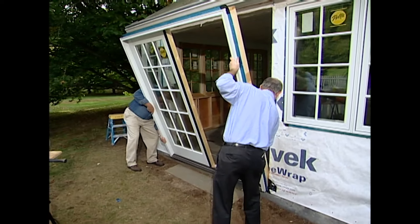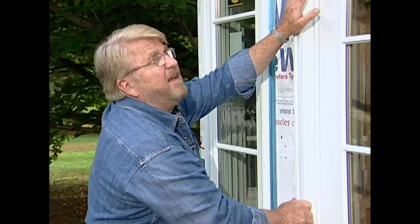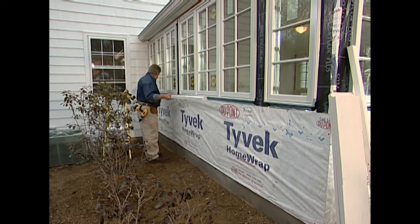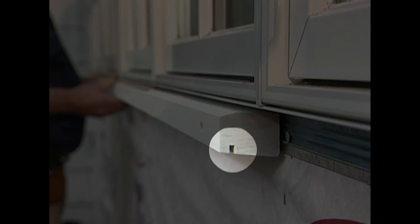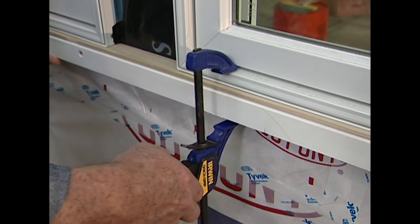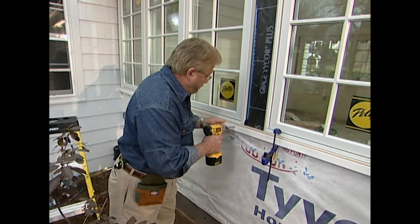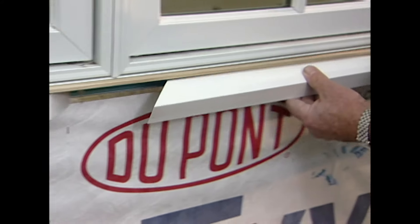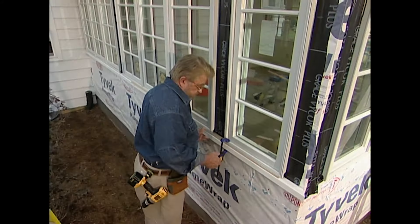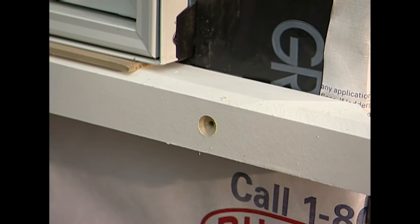I can't let Peter go yet. The sliding glass door is even larger than the window, but the installation is pretty much the same drill. With the windows and doors in, it's time to begin adding some exterior trim, starting with the sills. Notice the drip groove in the bottom — it'll prevent water from clinging to the underside and running down behind the shingles. I first clamp the wood in place, then secure it with screws. Adjoining sections are overlapped using a mitered scarf joint. Screw holes are countersunk so the screw heads can later be concealed with exterior spackle.